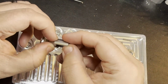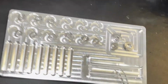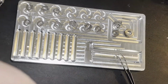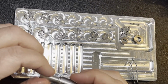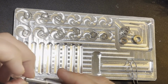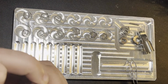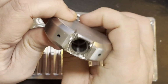So there we have it. We've got 9 discs, no false gates on any of them. I always find that interesting about these Chinese disc detainer locks. I don't know where this one's produced, but let me just say generically, I'm always a little surprised that they don't have false gates. From an engineering or manufacturing perspective, it seems like such an easy thing to do. I'm not sure what problems that would cause you, but it doesn't seem like there's really a compelling reason not to.